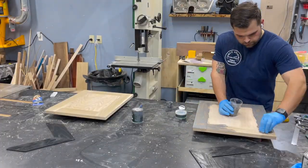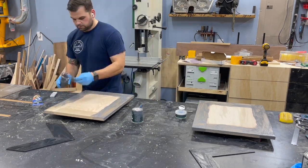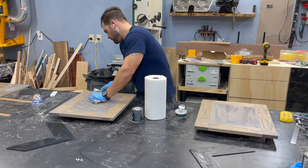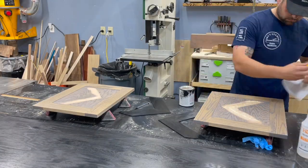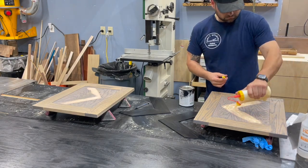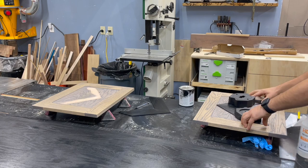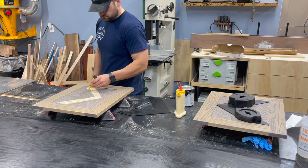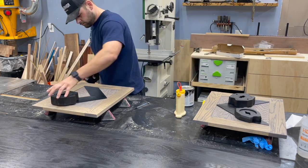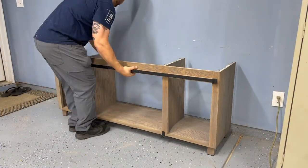The last thing was to put some finish on these doors — doing the back sides first, just like before: rub it in with a Scotch-Brite pad, let it sit, and then buff it off. To prevent the Rubio from getting on the chevrons, and also so they could actually be glued on, I made sure to trace out where the chevrons are going to land on the doors. Then using some weights and some clamps to set them on and let them dry — you don't need a ton of weight.